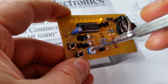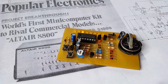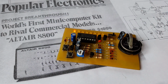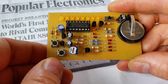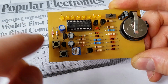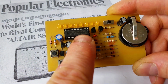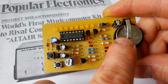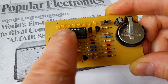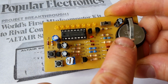So I'll discuss the circuit, and then I'll go over the circuit diagram. So if I just switch it off. I try to make it as simple as I can, and it just runs off a shift register here, which is a 74HC595. And you need the HC one if you want to run off 3 volts, because it is a CMOS version which can run down to 2 point something volts, 2.7 volts or something like that.